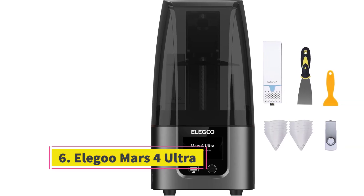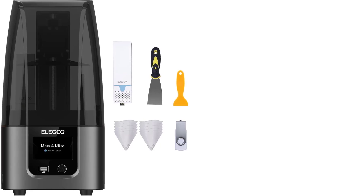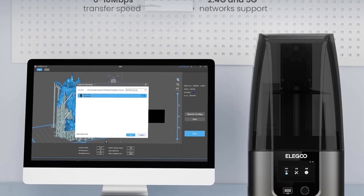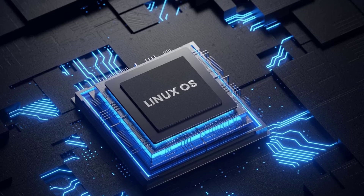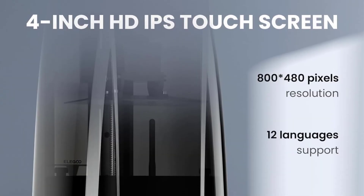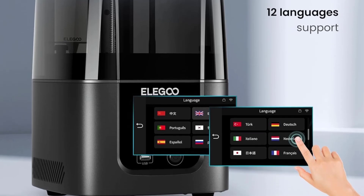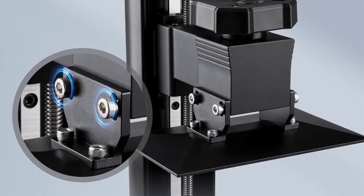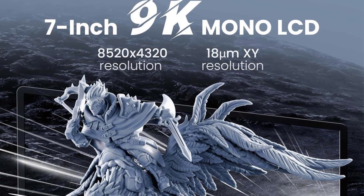Number 6: Elegoo Mars 4 Ultra. In our opinion, as long as it's still supported and continues to drop in price, the Elegoo Mars 3 is the budget resin 3D printer to beat. But if your budget stretches closer to $300, the top-spec variant of its successor, the Elegoo Mars 4 Ultra, isn't a bad place to park your cash. Ramming more pixels into roughly the same build area shrinks the pixel size down to 18 microns. If you value the bleeding edge of resolution in LCD-based 3D printing, this is it, though some users report the ACF film used as an interface layer in the VAT for higher print speeds muddies the detail, taking that resolution advantage off the table.